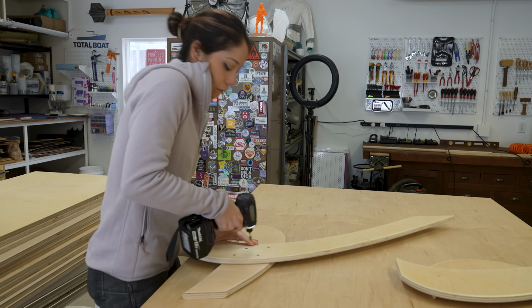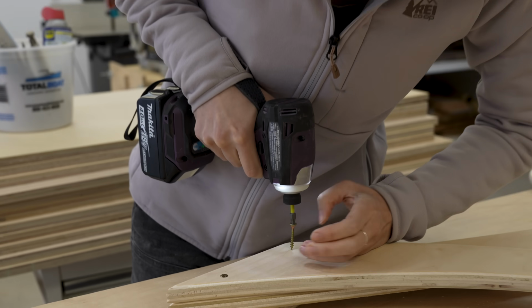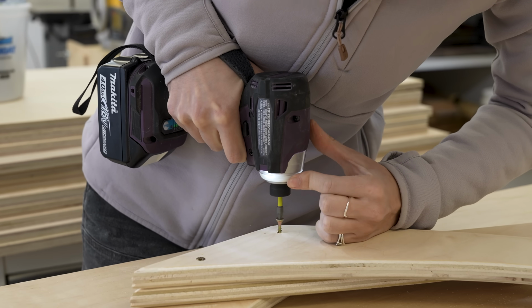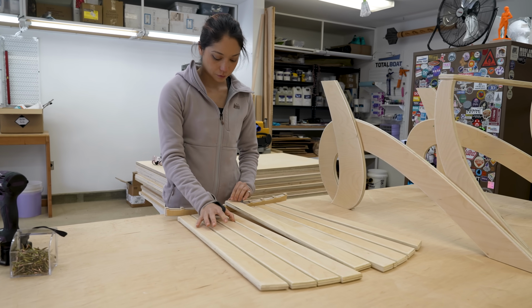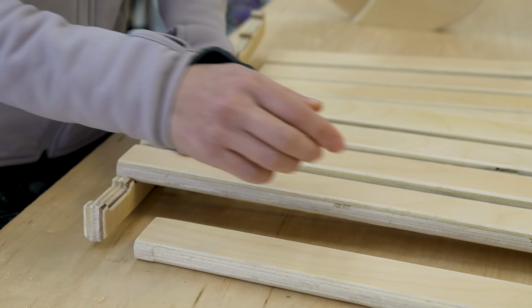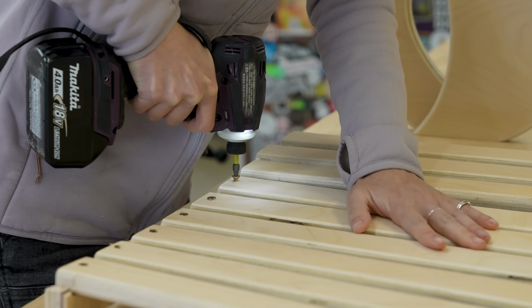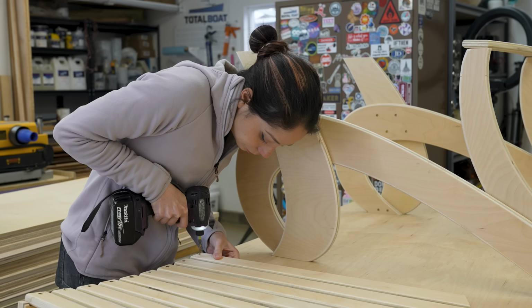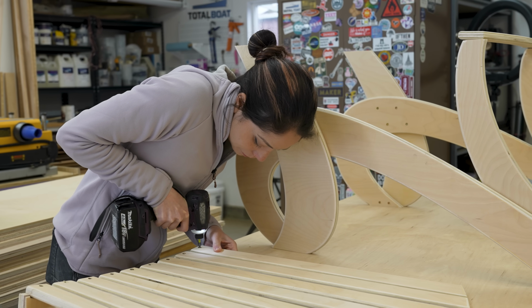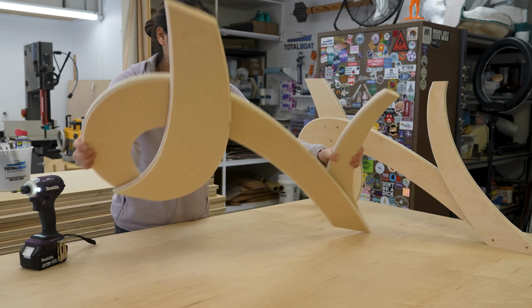I'm also going to throw a note in here and say that if you are making this chair and you want to stain it, I would stain it before assembling. I then assembled the back by screwing all of the back slats to the notched curved piece that will hold them all into place on the seat. And with that done, I got the two sides up, and then I could screw the middle back curved piece on, and that'll hold them at the right distance.